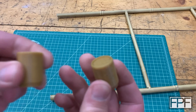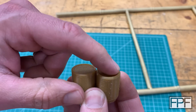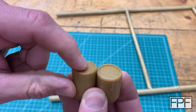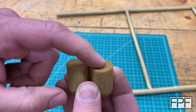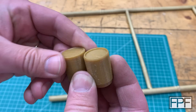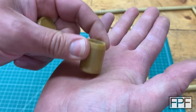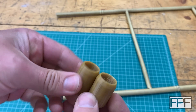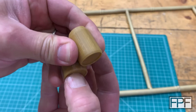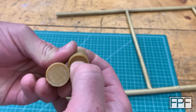Here is our updated test piece, side-by-side with V1. You can see just from the shadow line that adding only 0.2mm to the depth of this recess at the bottom — that's now going to be sufficient to retain the cork. I went to 0.7mm, which gives us 1.3mm of cork height exposed past that. I also reshaped the bottom so we have a much better approach angle to the cork. And I added one millimeter more of material on the bottom — yeah, that's definitely substantially better. The V1 pushes in really easy, this one puts up much more of a fight.